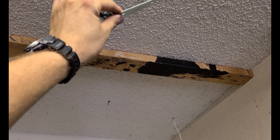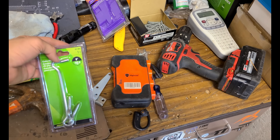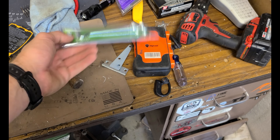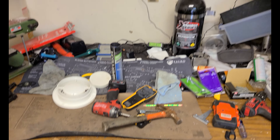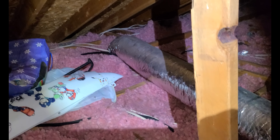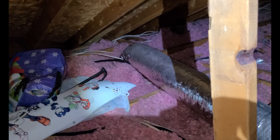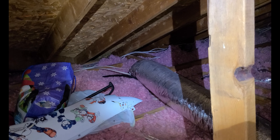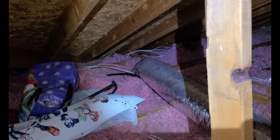I've got the hanger support up here and that's going to be for the hinged door that goes across. I needed another piece of plywood but used what I had left, so the long 72-inch door is actually going to be made of two pieces. I'll fix them together in the middle with some flat pieces of steel or something like that — not ideal, maybe it'll bite me later for not being sturdy, but that's what we're going to do. It's going to hang off of this two-by-four that goes directly into the joist with some three-inch screws.